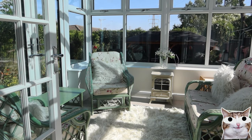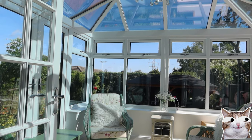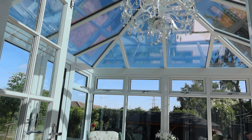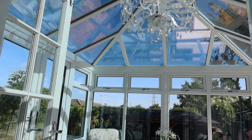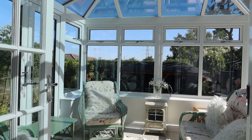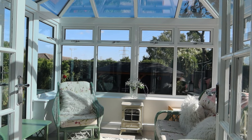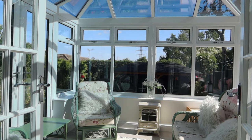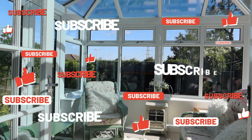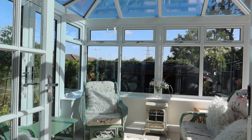Hello and welcome to MG Tracey. Our conservatory is just over three years old now and we've started to have the bane of my life with conservatories — little cracks and gaps appearing. I think this is because whether it's a wooden conservatory or this one which is UPVC over aluminium, the constant hot temperatures in summer and cold in winter make different materials expand and contract at different rates, and that's what causes the gaps. I'm going to show you how to fix that quickly and simply yourself today, just for a few dollars.